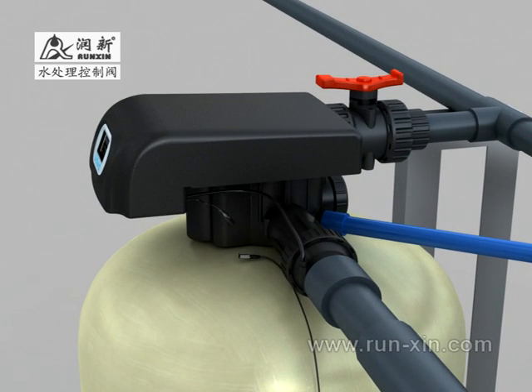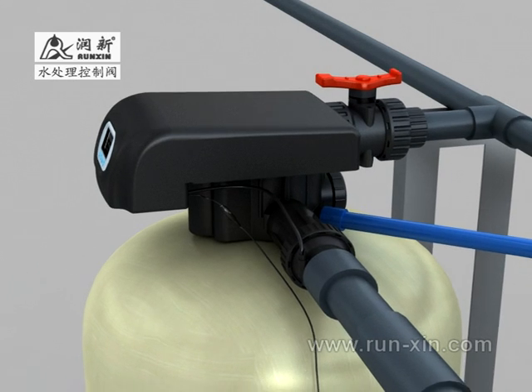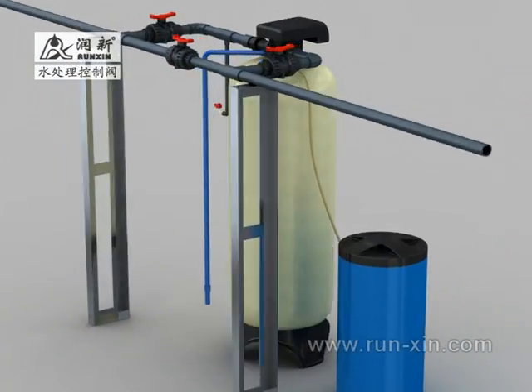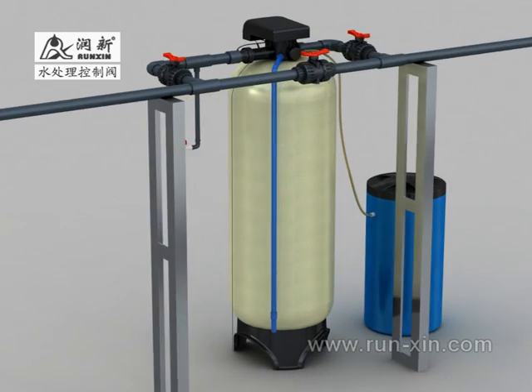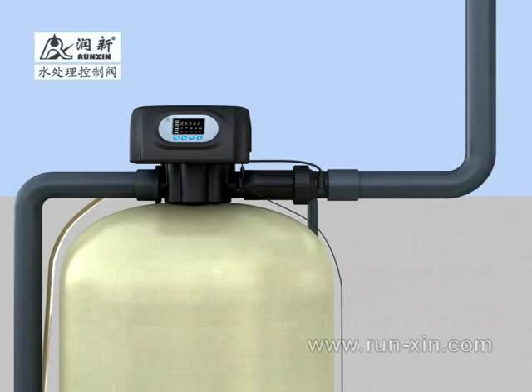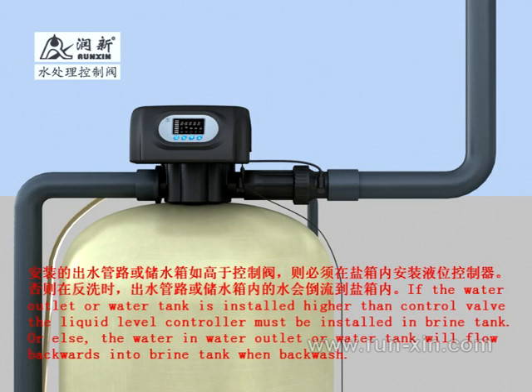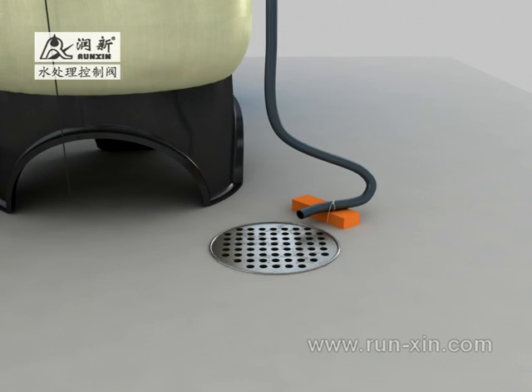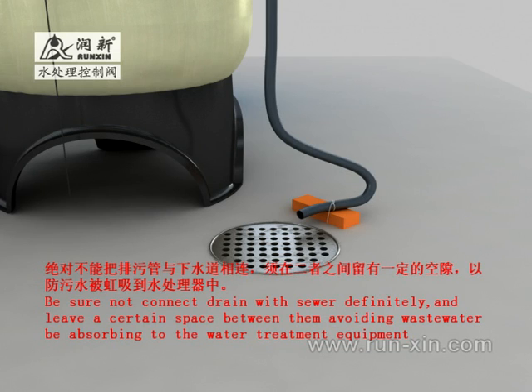Third step: adapter connection. Installation notes — It is advised to use PPR pipe, corrugated pipe or UPVC pipe; avoid using aluminum pipe. The connector of the pipe should be sealed and leak-free, otherwise it may affect the expected results or working flow. If the outlet pipeline or water tank is higher than the control valve, install a liquid level controller in the brine tank; otherwise water will backflow from the outlet pipeline or water tank into the brine tank during the backwash state. Never connect the drain outlet pipe directly to the sewer — there must be some space between them. If sewage is to be reused, it can be collected in a container, but there must still be some space between them.